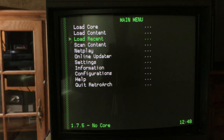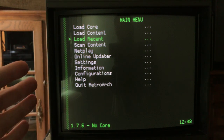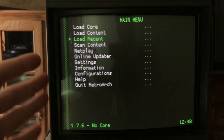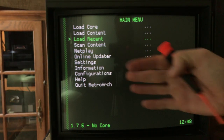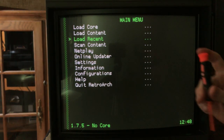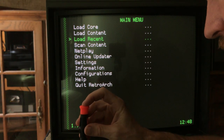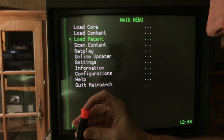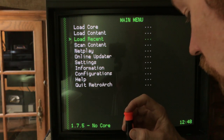Here's something I adjust all the time — the geometry. Going from an arcade game, which is how the screen is set up right now, to playing something at a 224 by 480i screen resolution, it's just not set up right. If I was going to play Willow arcade or Street Fighter II right now, I'd want to go into those geometry pots. We've got normal V-center, horizontal center.